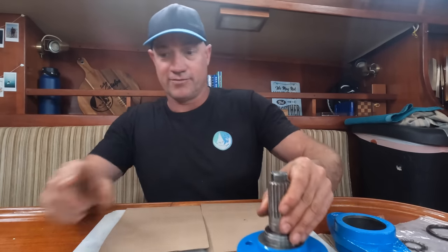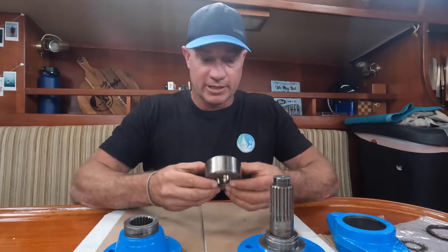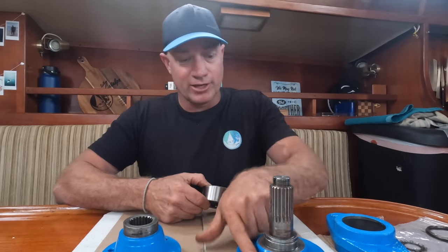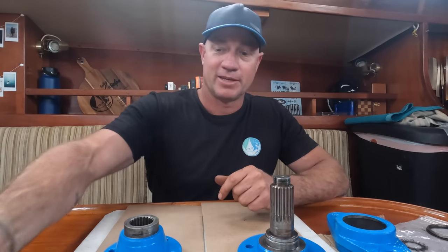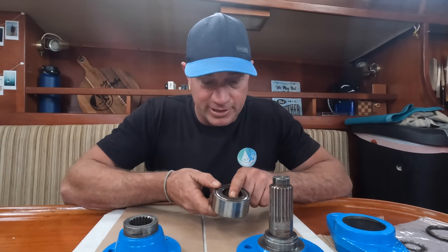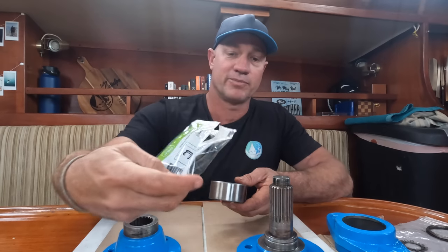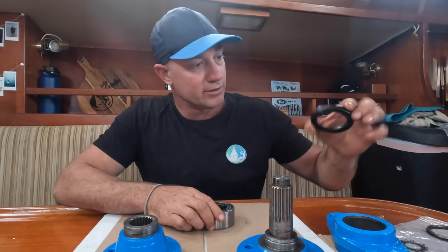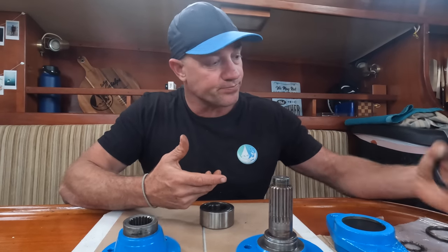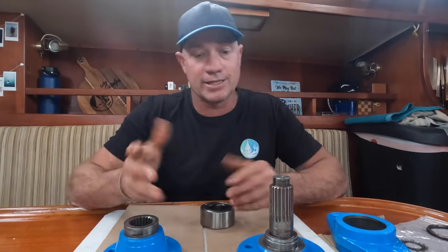We didn't have the finances to buy a brand new unit — not that we would have anyway, because all it was, was a simple bearing. This bearing was shot: it was rattly, it was whistling, it was carrying on like a pork chop. I've ordered the new bearings and new seals, and given it a nice little paint job — she's ready to go back together. Like all boat parts, I removed this, found the troublesome part, and did my research by looking at the product. It was an SKF bearing, so I called the company direct along with my shaft seal sizes. The radial shaft seals — one was pretty worn. One had measurements on it, one didn't, but no problem. I've got all three for the future in case something fails again, and I've got a reference for them.